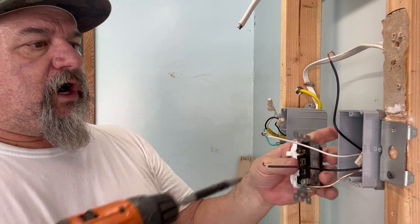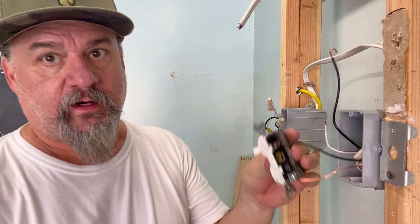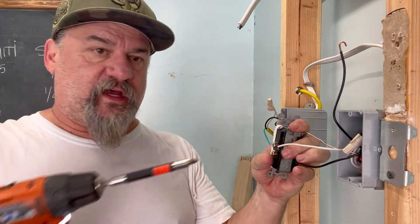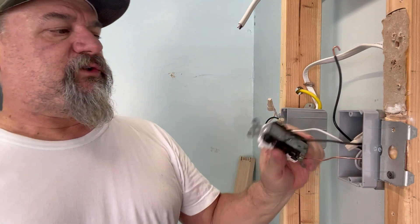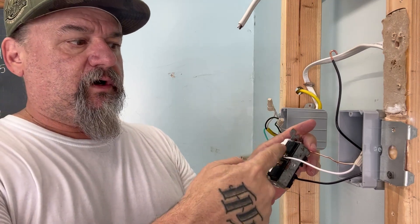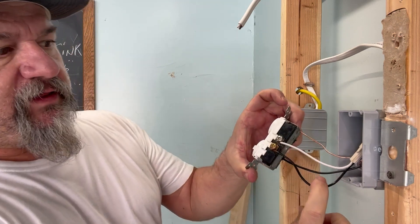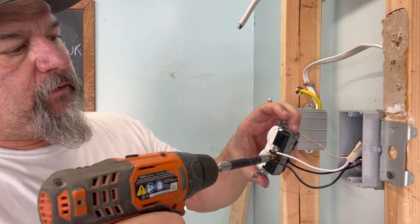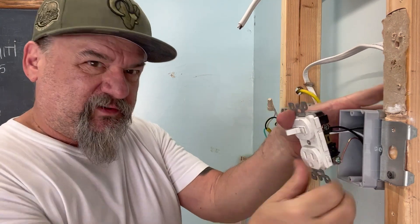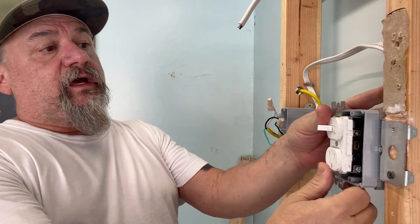There's your ground. Now the hot wire — I already know which one it is — put it around that terminal. On the other side, we know our neutral goes to the silver terminal, opposite the hot. For the switch side: the switch and plug are both hot, so keep them separate — if you tie those two hot sides together you'll get an instantaneous trip. Here's our switch leg going up — stick it underneath the terminal clockwise, tighten it. Take all the wires, fold them up and down so they don't contact the terminals, and push the device in. That's it.